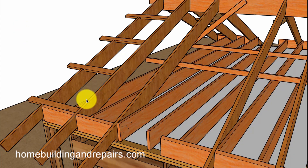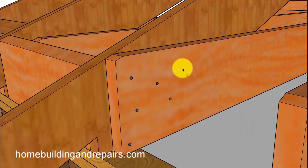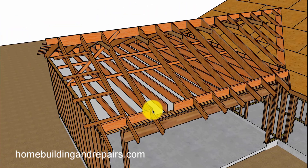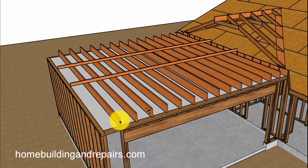Now let's take a look at ceiling joists. They're going to be spaced a little closer — 16 inches on center — and you can put a few more nails into the roof rafter if you'd like. Let's go ahead and remove the roof. 16 inches on center, 2-by-10, this is Douglas Fir. I looked in one of the approved span chart books and it said that a number two or better Douglas Fir can span up to 19 feet 10 inches, which would be okay for a 20-foot garage at 16 inches on center spacing.